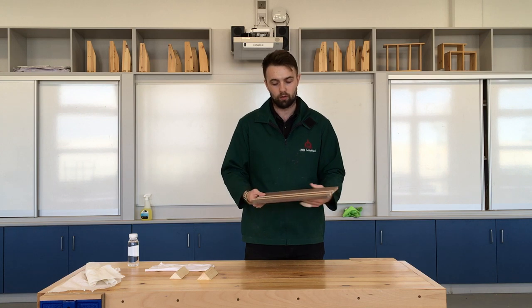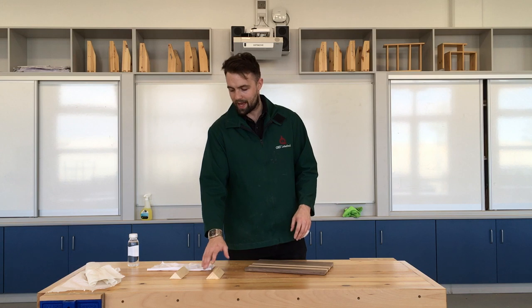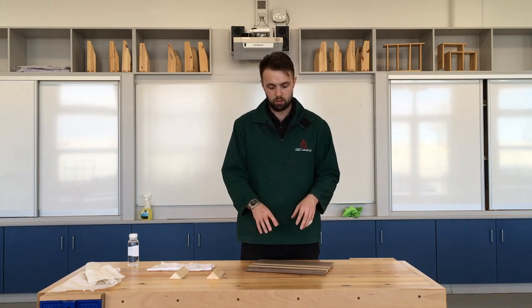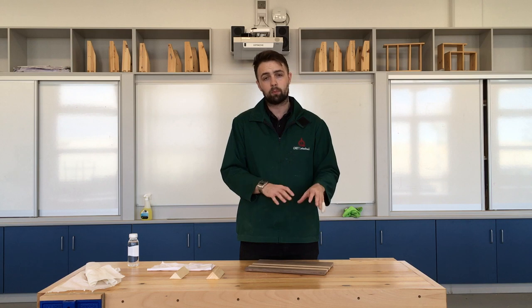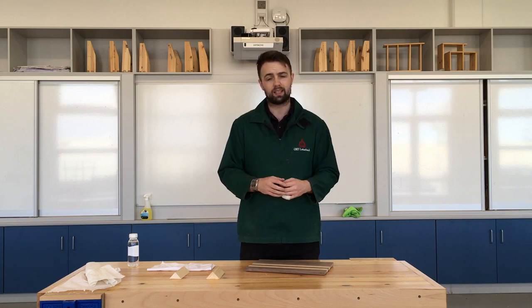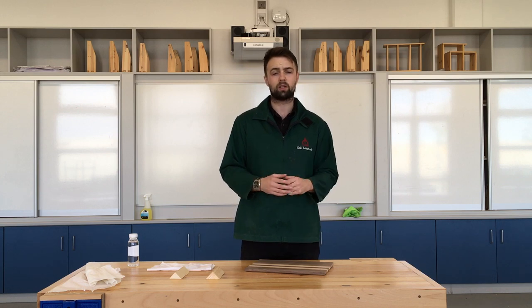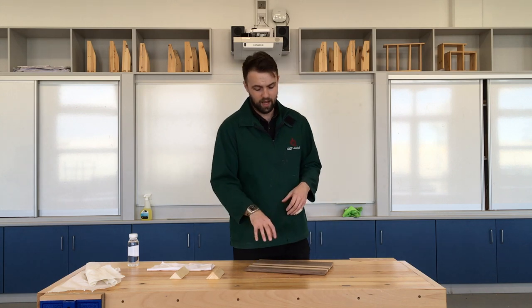What I have here is some mineral oil, some lint-free cloths, and some blocks to raise it up. We're going to do the first coat now, let it sit for a few minutes, buff it off after a few minutes, let it cure overnight, and then come back tomorrow with some wire wool to de-nib it and put a second coat on. It could end up with two, three, or four coats, repeating that same process. I'll bring you in for a closer look and show you the oiling with mineral oil.